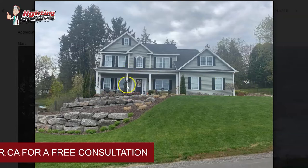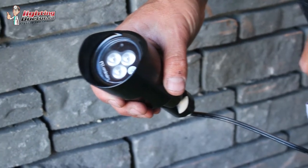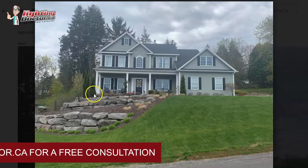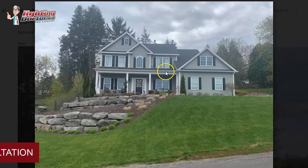The other thing I would do is highlight the house with some up lights. I love a house like this with the nice entryway, white columns, and porch area. I would take that up light I showed you and have these pillars or columns of the house lit up as well as across the front of the garage — one up light highlighting each front column and then one here. That light hits the top soffit area, lights it up, makes it look like you have soffit lighting, and gives you some reflective light down on the beds.